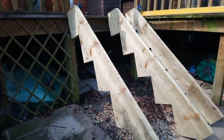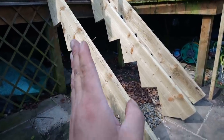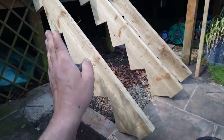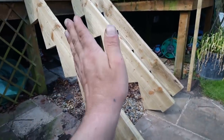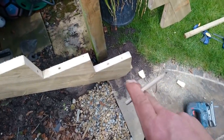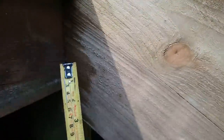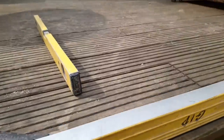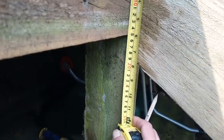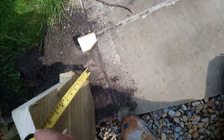So they're upside down at the moment while I get some treatment on those ends. I've got a spare piece of this 6x2 so I'm going to bolt that across there, and I think I'll sit these on rather than pushing up against, because they're quite a shallow pitch — I think sitting on rather than leaning against like a normal staircase would be better. I just had to whip a corner off down there just so I can get it down. That's level, and I want this top edge to finish here. The top deck should give me 150mm — I'll measure up, cut it off.